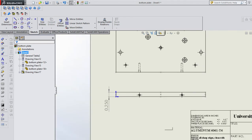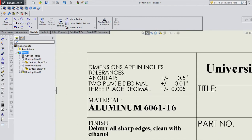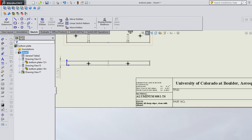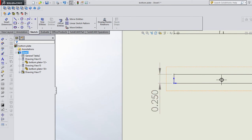Like I said, in general with machine tool technology, we can pretty much easily get plus or minus 5/1000ths with the conventional machine tools. So a 3-place decimal might want to be plus or minus 5/1000ths. In this case, the 1/4 inch doesn't matter all that much. It's a nominal plate size. So that plate may come in as .248 or .24 or .252, something like that. Or maybe even more than 5/1000ths off. And I don't really care in this case if it's 10/1000ths off in thickness, right?